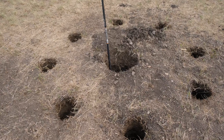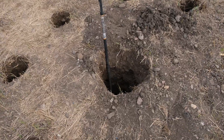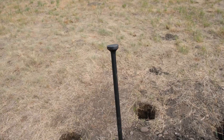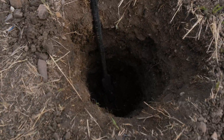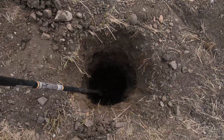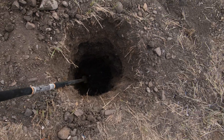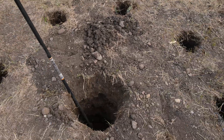Here is the result — you can see all those holes dug out and the pier hole. The pier hole still needs a little more depth; it's about three feet right now and I want to get it down to four. One other tool I should mention is the breaker bar — absolutely phenomenal. It's a big heavy steel bar with a nice point that you can use to pull rocks out of deep holes, wedge in there and really get the rocks out.